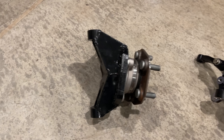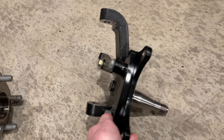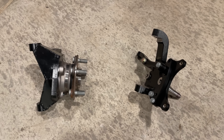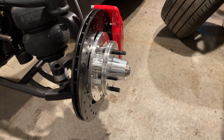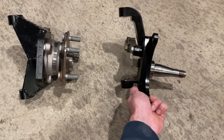I'm replacing a spindle with an upright. So what's the difference? A spindle looks like this — it has bearings that go on the part that sticks out, and the hub spins around those bearings. Usually these are tapered bearings, and when you preload them by tightening down a little nut ever so slightly, it squishes them together.